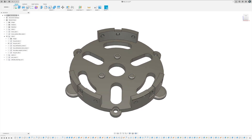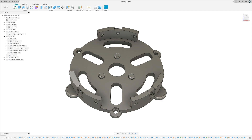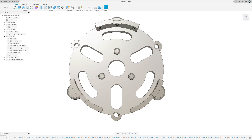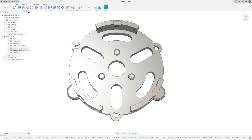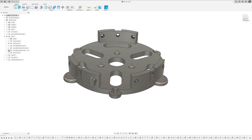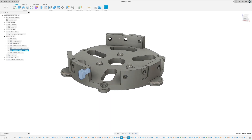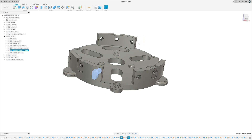For edge supports I'm using what I'm calling a modified whiffle tree — modified in the sense that it doesn't pivot at the 45-degree mark like it should, but I took some liberties given the small mirror size. I'm printing nylon thumb screws that go at the traditional 22.5 and 67.5 degree positions. If the scope tilts, the mirror rests on those edges. There'll be six of these edge support screws all around.